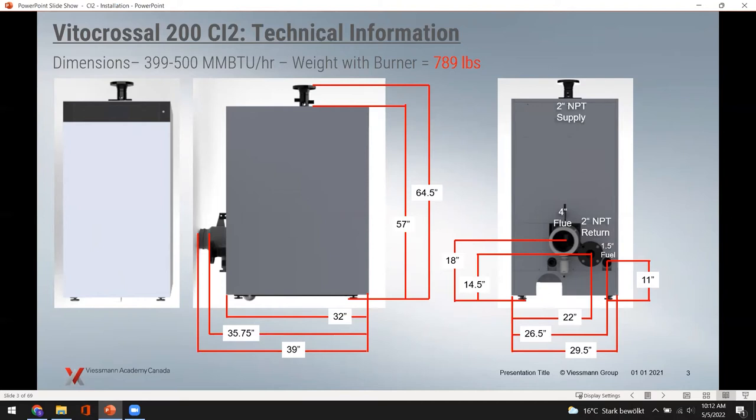The vent at the back of the smaller units is a 4-inch diameter flue. Combustion air is mentioned about seven times in the manual — we take it seriously what's coming into the boiler. There's a knockout at the bottom where you can connect outside air via a conduit to the back of the unit. The sides of the boiler are basically just a pretty gray — 'Vito Graphite,' they call it.